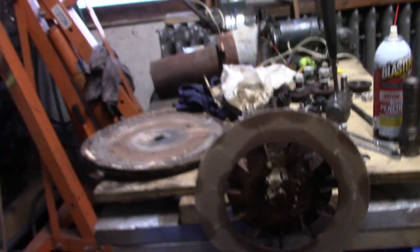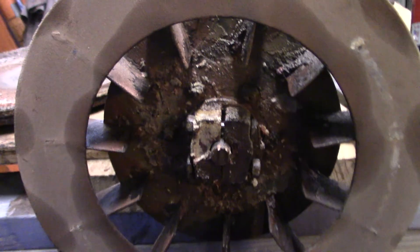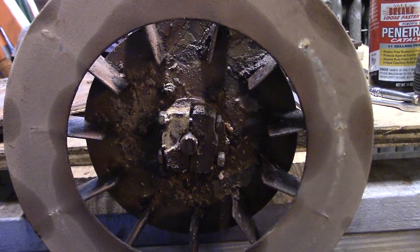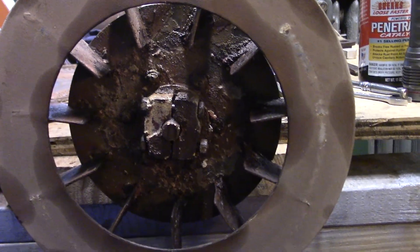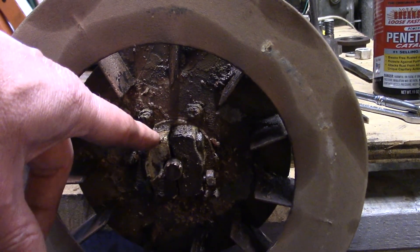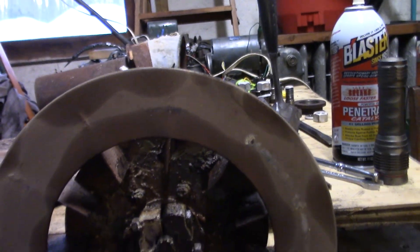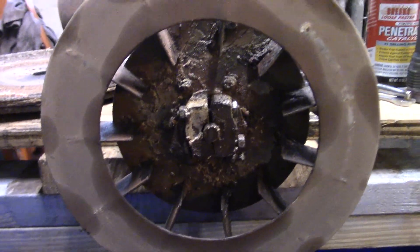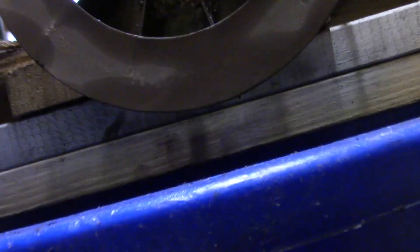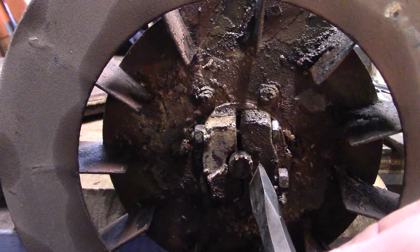We also lucked out with the fan. So typically when you get these, it's a clamp with two bolts that are facing the opposite direction. Once you get those loose, you've got to fight with them because they're pretty brutally tight. Usually what will happen is one side will come loose without any trouble, and the other side will be stuck right to the shaft. That's always what happens, but this one must be fairly new because it was stuck really good. But all I did was take this chisel, put it right about there and smacked it really good with the hammer once and it popped free.